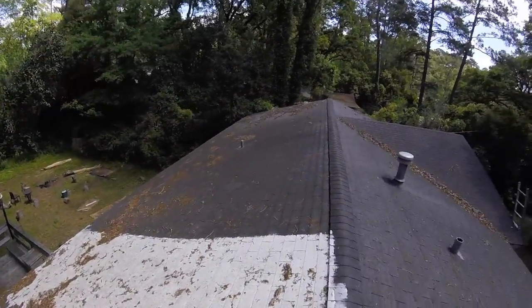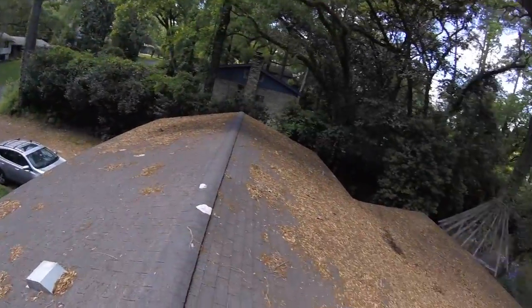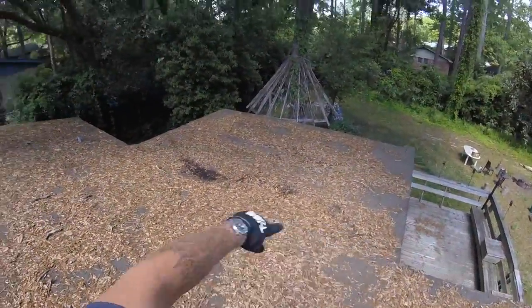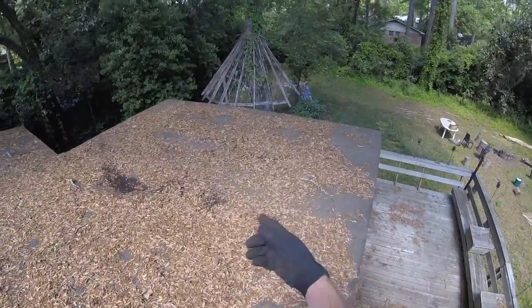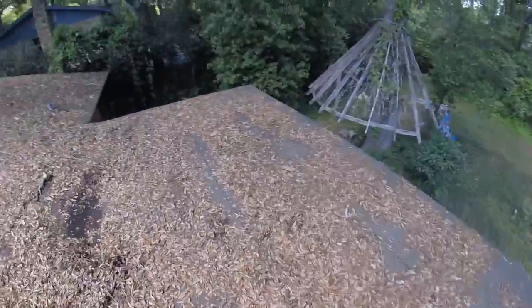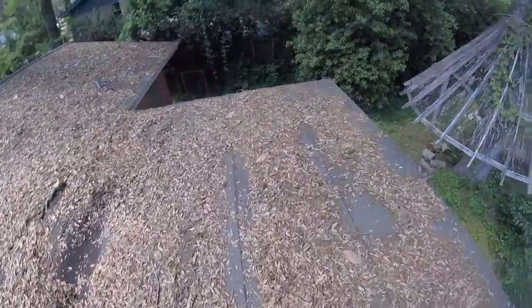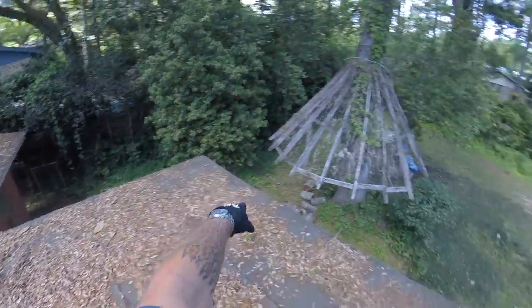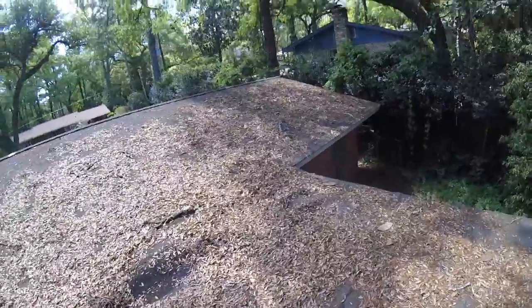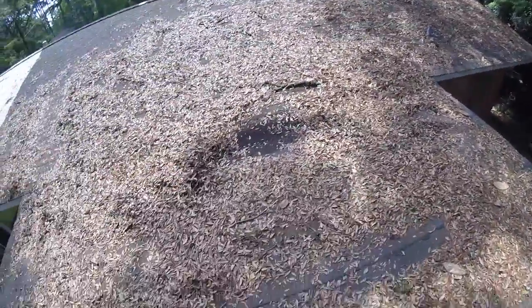So you've done some repairs up here in the past. Pretty straightforward roof. The only thing I would mention is kicking around some leaves around this transition and also on the seams of this flat roof material. Everything looks and appears to be tight on this still. Even around the perimeter you still got good adhesion. So we can talk about leaving it and maybe budgeting it out later on, or if it is an issue now we can go ahead and get it taken care of for you.